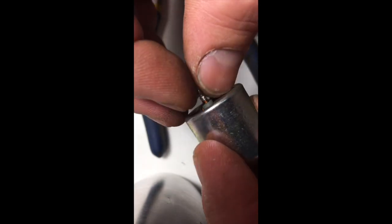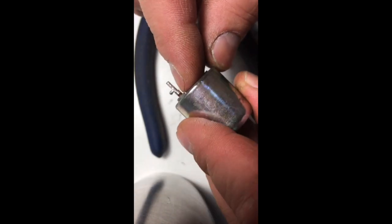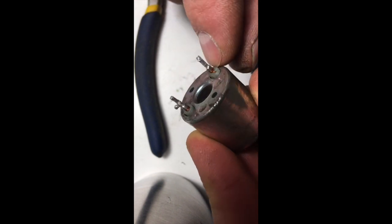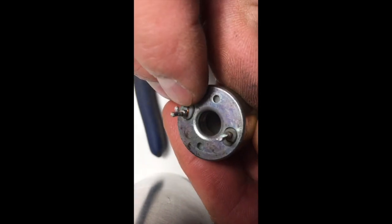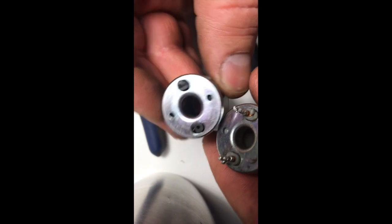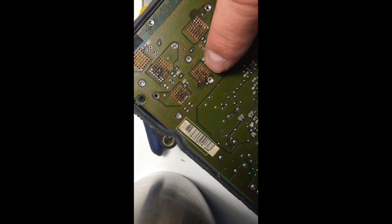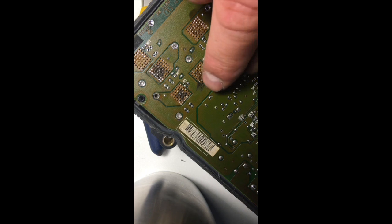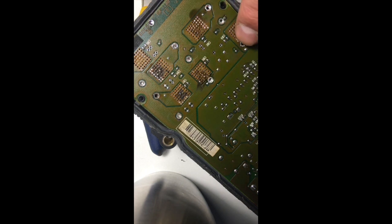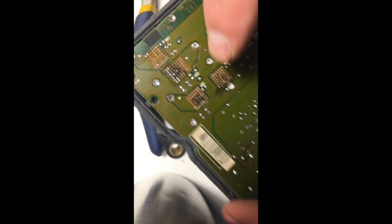Those pins are loose in the plastic, which is still a bit hot. My plan is to glue this, inspect all the little wires, repair the wires on the board, hollow out all the holes, and pre-tin them — actually they're already tinned, so I'll just hollow them out with a drill bit the right size for the pins. Then I'll put the coil in from the bottom and resolder the pins.